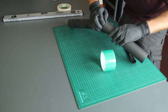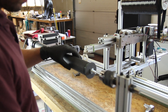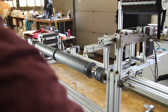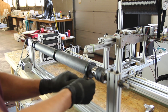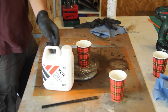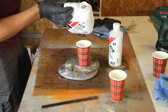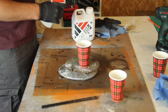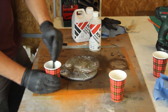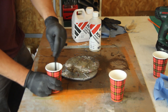For the roll-wrapped tube, the finishing layer ended up somewhere in the diameter of the part, leaving a little bevel where the last layer finished. That's why we'll be finishing all these tubes with epoxy resin first. You can compare it to adding bondo or filler on top, then sanding it flat to get a perfect finish before adding clear — but here we'll be using transparent bondo, which is epoxy resin. This enables us to remove a bit of epoxy at certain points to get everything back to a tube or rounded shape. I'll be using XCR epoxy resin.